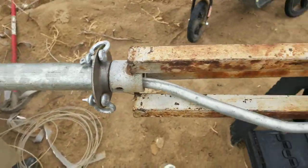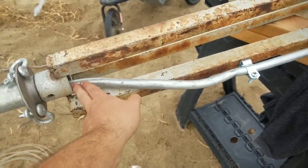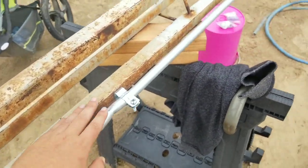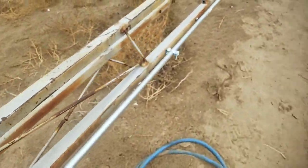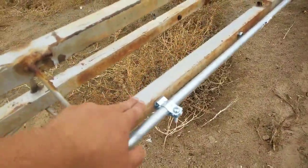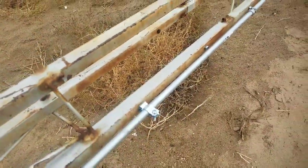Wind generator, I guess it would be called. We have conduit going through the pipe, so it'll be protected. Bent down and around, hugging this edge. Now, roughly every 5 feet or so, we have conduit clips installed on the outside face. They just have a single self-tapping sheet metal screw, which you just buzz into the metal, and then they clip the conduit.